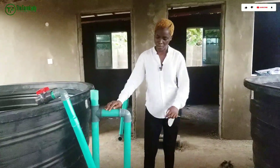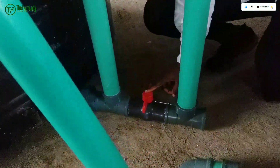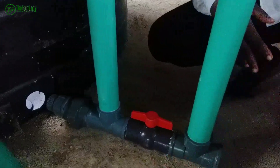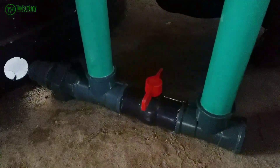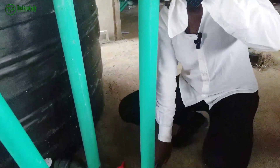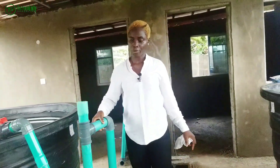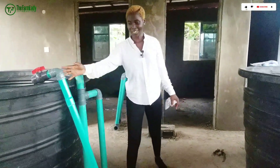When I want to do a total discharge of water, this air valve here is closed. We're going to open this outlet up, and then we have a total discharge of water. When we want to observe flow-through, this valve is going to be closed, and our water flows from up and passes through and flows out. So we constructed this so we can do a total change of water and also achieve flow-through.